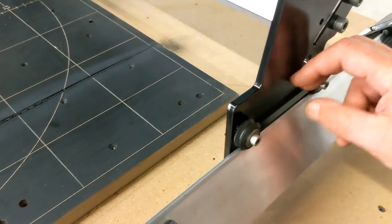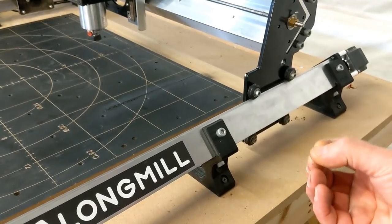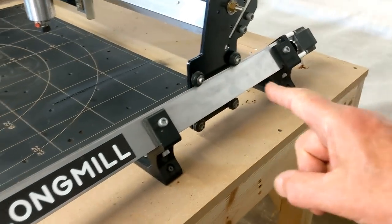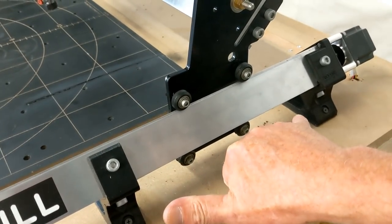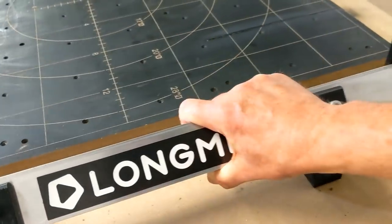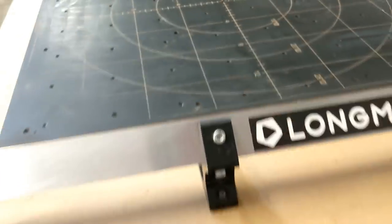They use these V-shaped wheels that ride along the corners on the top and the bottom. So that was brilliant by combining the structure with the travel aspect. The other thing that they did was they bolted this thing down in four different places along the length, while they kept it clear for the travel. So there's only 1 foot, approximately 12 inches or 300 millimeters between each foot on here. So that makes this bracket or structure, guard, guide rail, whatever you want to call it, extremely strong when it's bolted down. Now, I want to say something.